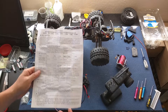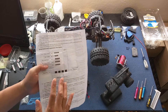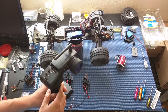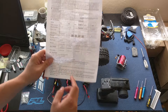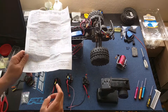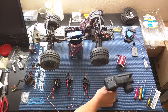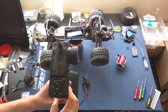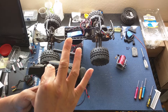There is actually no way to program this speed control without the programming card, and we didn't order one. The way you set the maximum throttle and neutral is described in the instructions: you should hear a beep-beep when you turn on the ESC, and then another beep-beep-beep when the throttle is in the neutral position. We didn't hear the second beep-beep when we first powered this up, so I'm just going to make sure our throttle is at neutral.